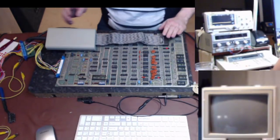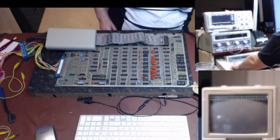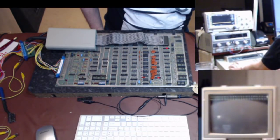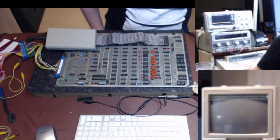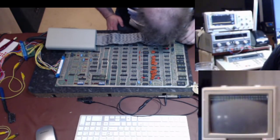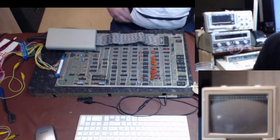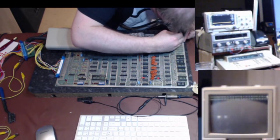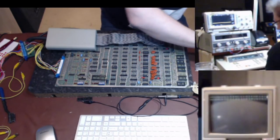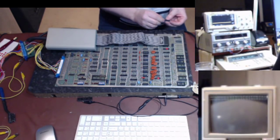Okay, so we've got our trusty thing on there. Switch you on. Bus test. So I'm basically doing multiple bus tests. And I'm not getting nothing. So I'm going to naughtily put this chip back into circuit as is. There we go. So we have a problem. That one away, put a brand new one in, and hopefully the problem goes away. He hopes.